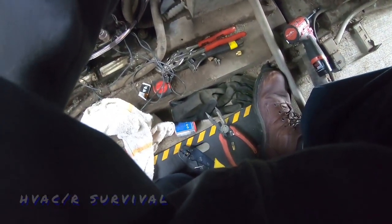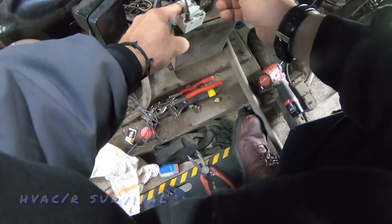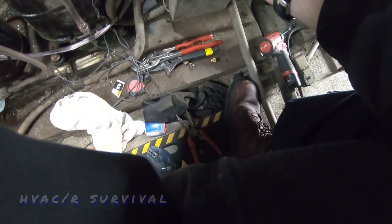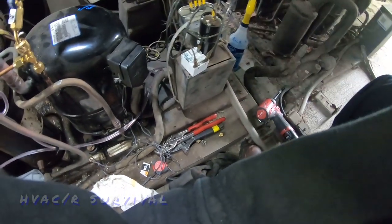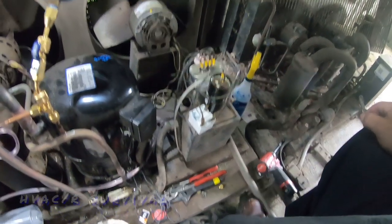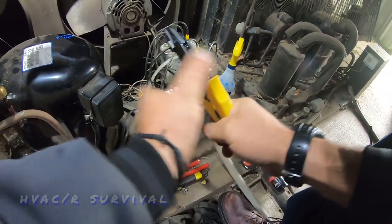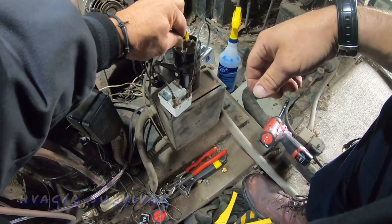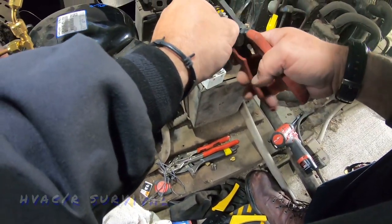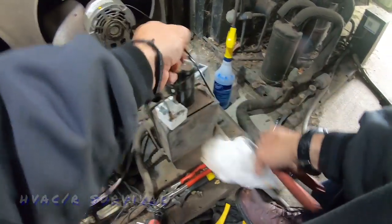I always replace my connectors whenever I'm reconnecting onto a capacitor. That one pulls off pretty easy, that one pulls off easy — so we need to redo those too. It's important to make sure these are tight; there's a lot of amperage going through there at first and that's going to wear things out. These came from a place called Cleveland Tool — I'll leave a link down in the description. Check the description area of my videos for anything I've used.